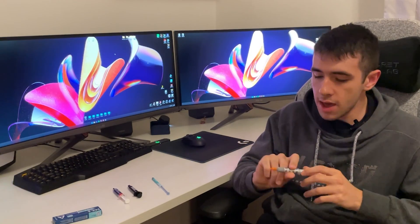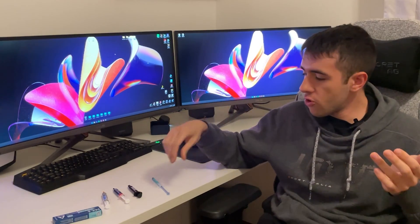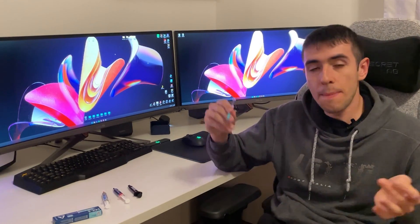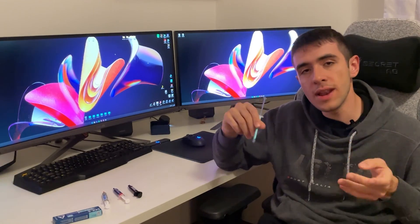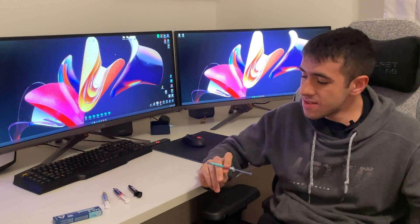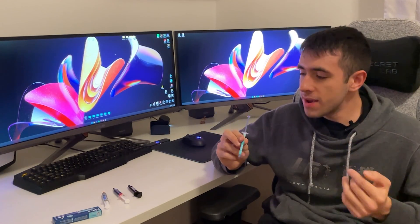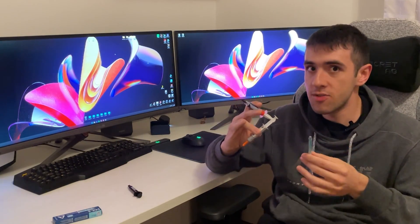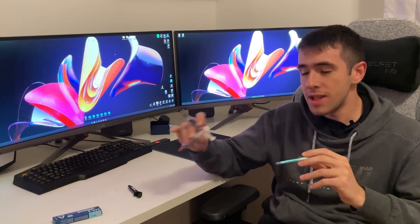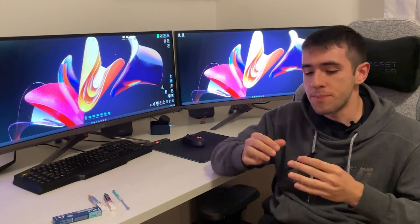Spreading is very important. The reason why I showed you the footage of me dismounting the PC — just to show you what the paste application of MX-6 was like — is that I just did a little dot, then put the paste around randomly like anybody could do. I didn't really apply a particular force when closing the cooler, just slapped it on top, and it came out spread perfectly. That's something really important to me — ease of use. I really like the viscosity of MX-6, as I do of MX-4 and GD900; they have the same viscosity. I didn't really like the MX-5 from Arctic because it was difficult to spread, even though it was very good performance-wise. And Thermal Grizzly falls into the category of pastes that are a bit more granular, at least in my opinion.